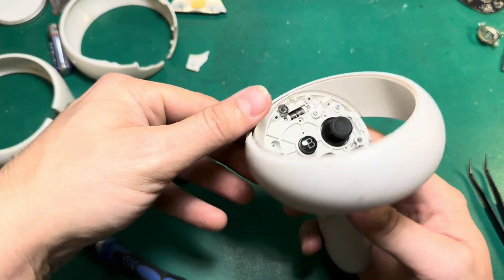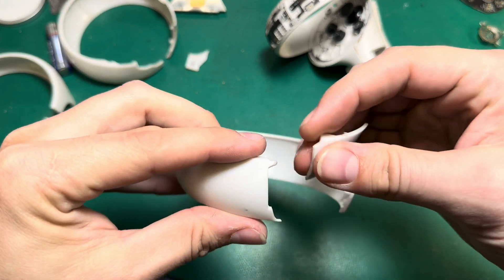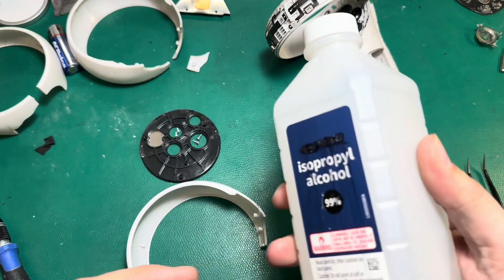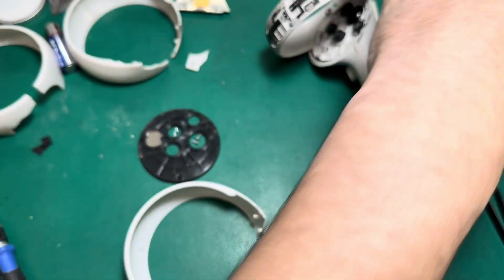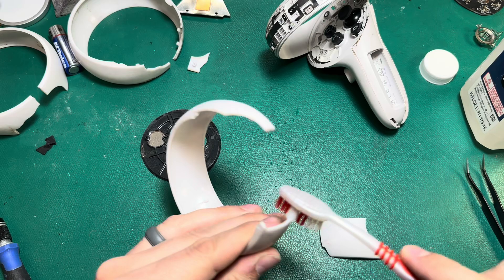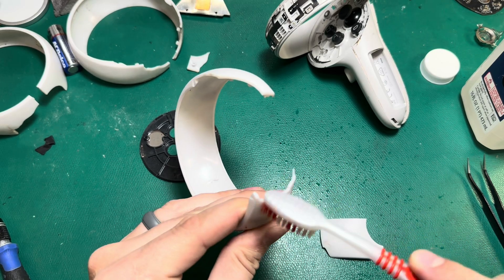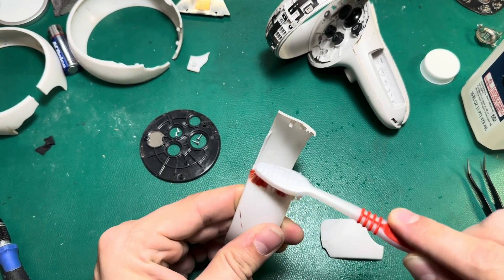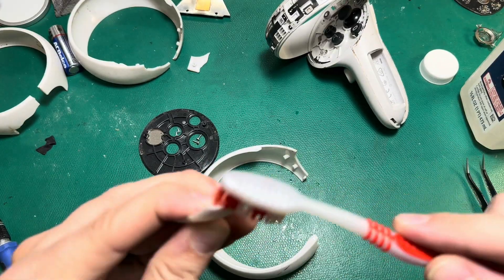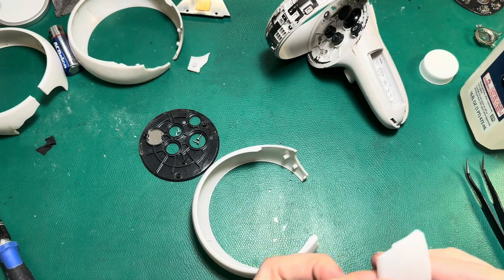Both parts of this ring should just come off now, and we've got the whole ring in two pieces — and it fits together quite nicely. Step two: I'm going to take some isopropyl alcohol and clean this off. I'm going to clean off both sides of the ring so that there's not a whole lot of dust and dirt and debris. Sometimes there are little marks or a bit of liquid that's gotten into the cracks, and we want to make sure none of that is present for the adhesion process.